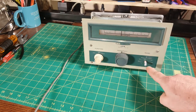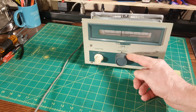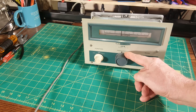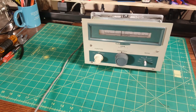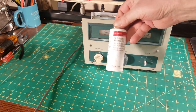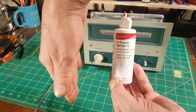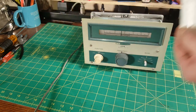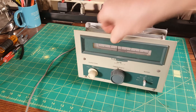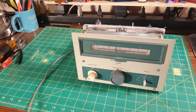What I will do is take all the knobs off. If there's a bushing behind the knob — there are not on these switches, but there's almost certainly a quarter-inch bushing behind this frequency control knob — I lubricate it. What with? Light machine oil — the kind made for lubricating sewing machines and embroidery machines. Exceedingly nice oil.